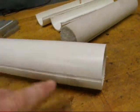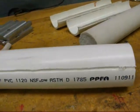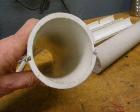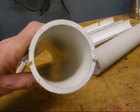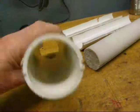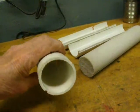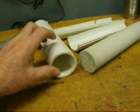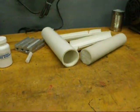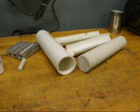I've made these little slits in the pipe on the milling machine. It's not necessarily required, but it makes it easier later on when I go to cut this in half with my Dremel tool — I only have half as much material to remove. This PVC is 78 cents so it's expendable.